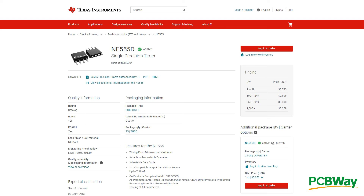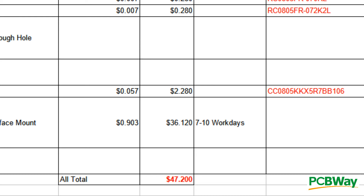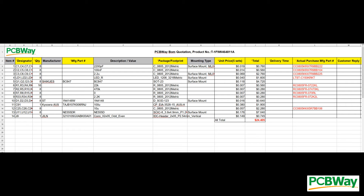Even with 555s, I experienced a further problem. When given the specification of a 555 timer, the person handling my Bill of Materials document found a Texas Instruments NE555D — an ideal chip — but surprisingly expensive. The cost just in 555 timers alone was something like 36 US dollars, enough to make it not cost effective to go this route. Remember how I said the machine wants a reel? The NE555D is sold in tubes, not reels. Having done some research, I found Texas Instruments also sell the NE555DR. R for reel. And that big cost was cut right down to around 10–15% of what it was before for the whole run. That one change made this viable, and the order was placed.